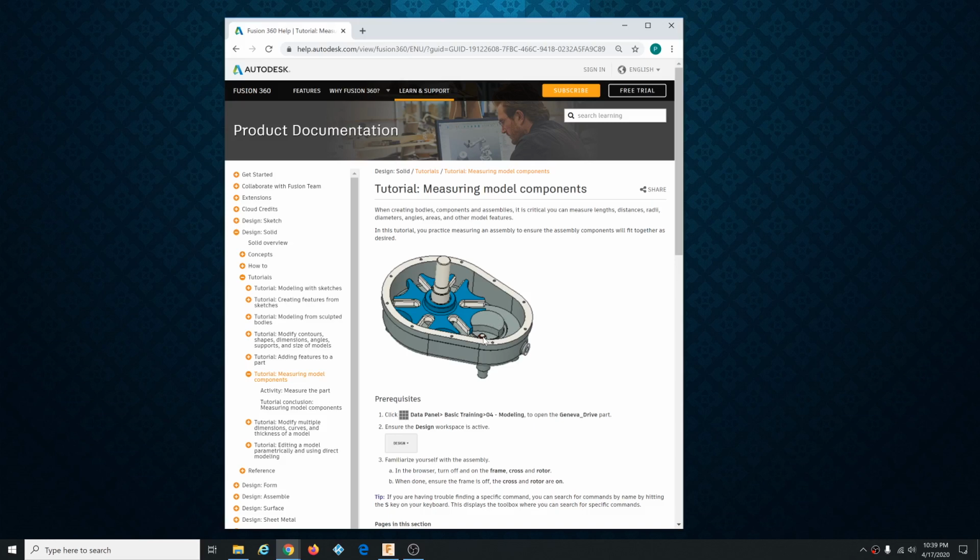And then this little cam on it will pick up one of these slots, and it'll index, or it'll turn the Geneva wheel here by, looks like, how many are there? 1, 2, 3, 4, 5, 6, so 30 degrees. And then it'll stop. So the Geneva moves like 30 degrees, and then it pauses for some degree as this thing turns around, and then it moves another 30 degrees. So it's a way of turning constant motion driven by a motor into an intermittent motion with pauses in between.